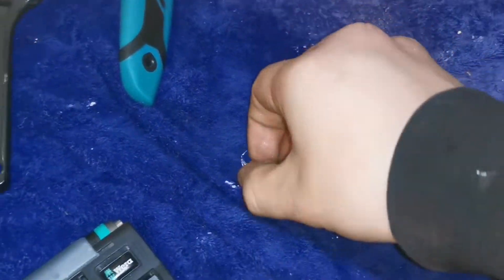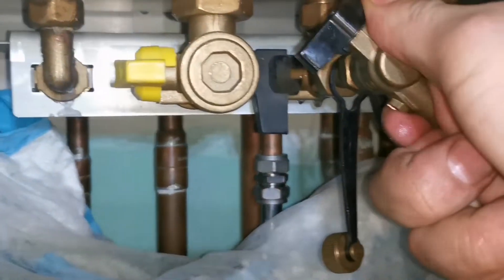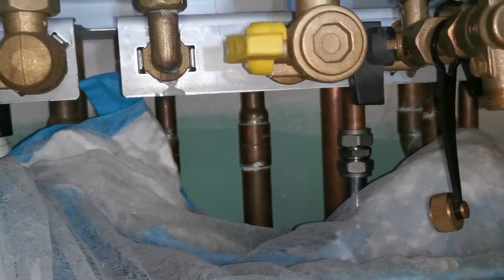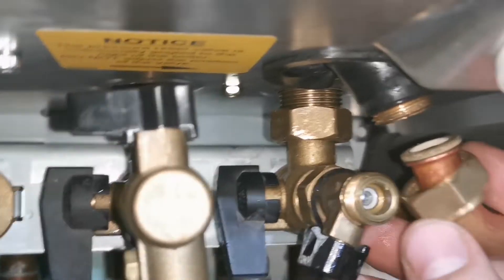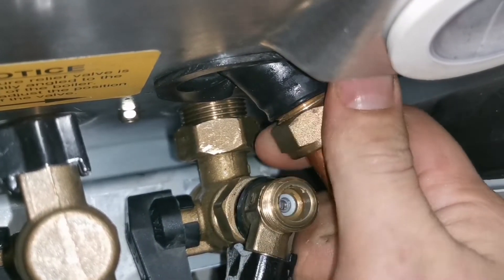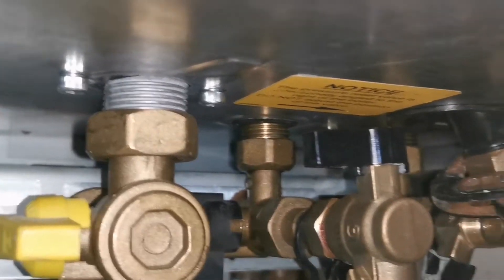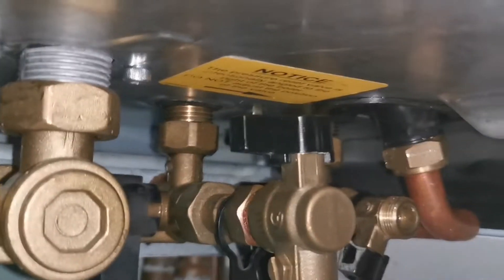You've got to loop it up. Just moving the filling loop out of the way — it makes it so much easier with the ratchet and spanner. And the PRV goes back on. Then obviously fix up the grommet washer. Sometimes when it's a bit of an angle or difficult to get to, it's just easier to use grips instead of adjustables.